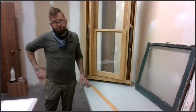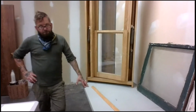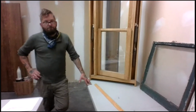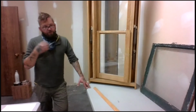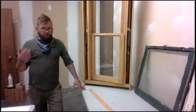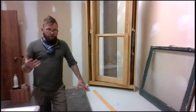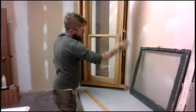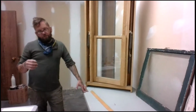I have terrible vinyl replacement windows that smile at me. I kind of wish I had leaky old wooden windows, and they did not insulate the cavities behind the windows. I feel a huge breeze behind them. If you have vinyl windows in your house, one good project to do in the spring, when it starts to warm up, is to pay attention to where it's coming in during the winter. Obviously, if you're feeling drafts around your window like that, then most likely no insulation was put in when the windows were installed.